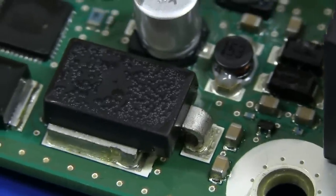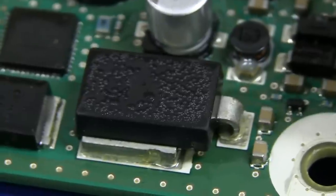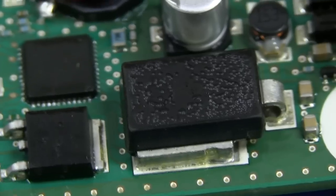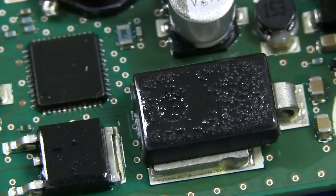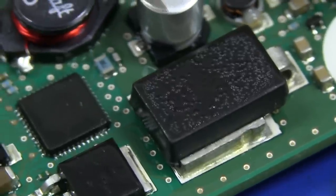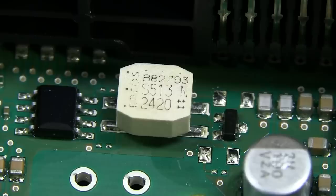There's an unusual two-pin package — one large pin on the bottom and one J-lead coming out the side. It's probably some sort of diode or something like that. Can't see any type markings on the top through that bubbly conformal coating, but yeah, most likely some sort of big diode. Look at the huge pad on the bottom and how it's heat sunk. And there's a four-pin data line choke there to keep all the crap off the data line — probably part of the CAN bus.